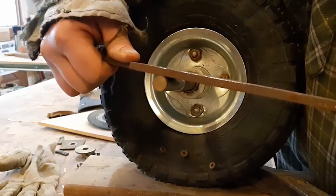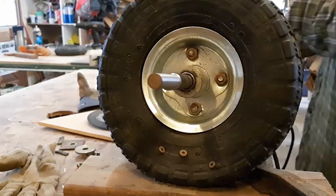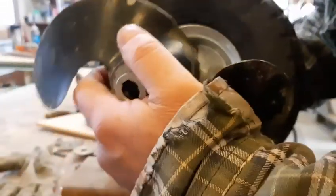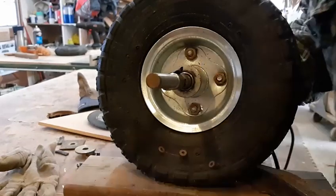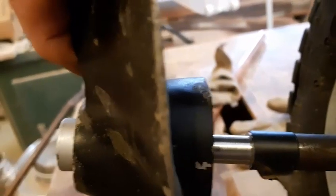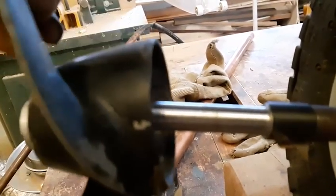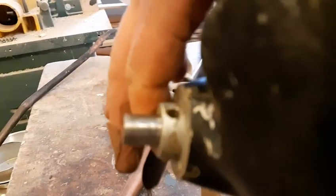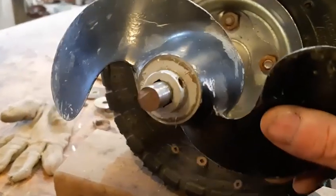Before I go too far, let's see how that's looking. Now much smoother - she's close. I think I'll work on taking the rest down with the file. So there's the prop on - no shear pin on as yet. That was done with a grinder and a file, just set up in a wheel bearing. Not bad machining, not sloppy - it's on there pretty good. That should do quite nicely. It's not a different shaft welded in or any attachment - that's all the same piece.